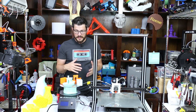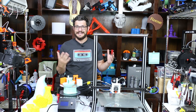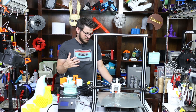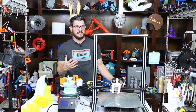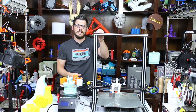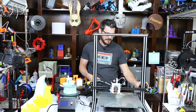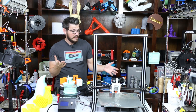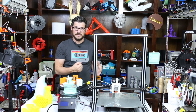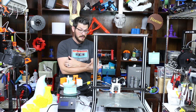Basically the moral of the story is there's no moral — I kind of just wanted to give an update on what I'm trying to figure out and working with this machine to be a little bit more than what it is. This was one of the early versions when 3D printers were just starting to expand and get huge — I received this over a year and a half ago. I have new bearing holders up top because these lead screws are so long they do need a little bit of support, and the actual Z gantry is such a thin sheet metal it's not really that sturdy. I'll hopefully get a new left side for this, get that replaced with some eccentric nuts, and look online to see if anybody has created any remixes for this.